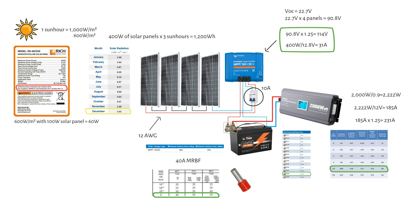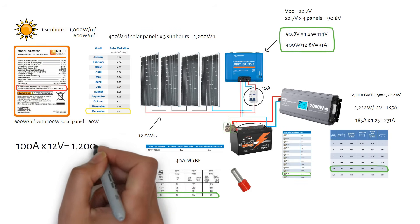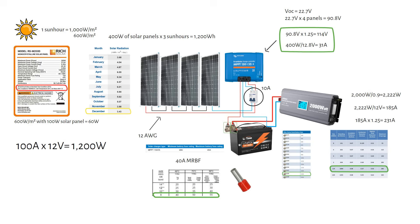If you are experienced with off-grid solar design, you might have noticed something unusual. The high current draw from the inverter versus the 100 amp BMS inside the battery. The BMS, or battery management system, regulates the current entering and leaving the battery. It's designed to protect the battery by limiting current to 100 amps, which ensures safety and longevity of the cells. If we draw 100 amps at 12 volts, that equals a maximum power draw of 1200 watts from the battery — but our inverter is 2000 watts. If you try to run a continuous 2000 watt load, the battery will likely shut down to prevent damage.